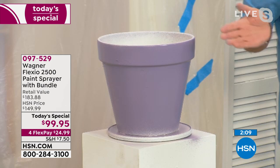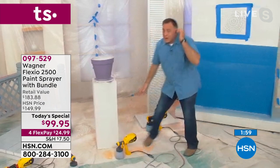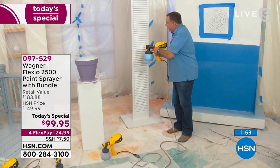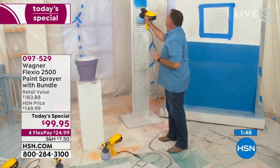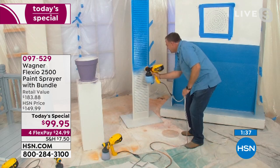I'm going to jump over to my louver door and this time we're going with the iSpray nozzle — the big guns. Watch how fast we can do this. If you've ever painted a louver door and tried to do it with a roller and a paintbrush, every single one of these louvers you have to get in there and do what they call stippling — just jam that brush in and out of there. I'm going to be done before the clock is down. Boom, boom, boom — I am done.